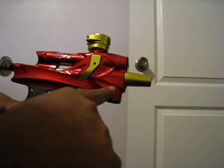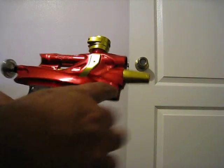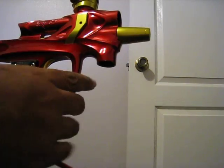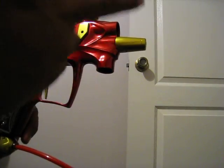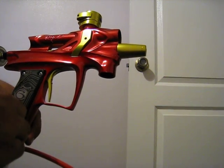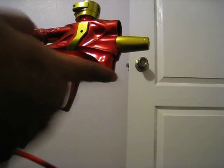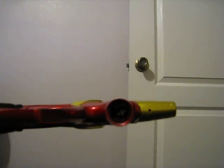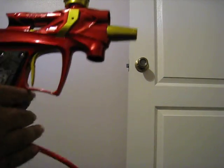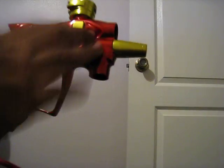What happened was the screw that goes in here — I don't know if y'all can see it, it's in there — it basically got stripped. It opened up, it stripped it, I had to re-tap it and get one size bigger of thread. We put a new screw in there — I don't know if y'all can see it, it's a little dark in there — but I have a different screw in there. I got it to close shut and it doesn't leak.